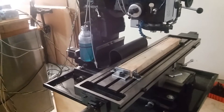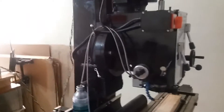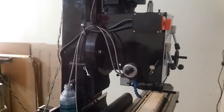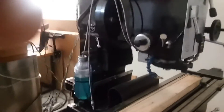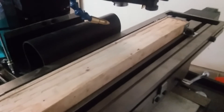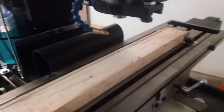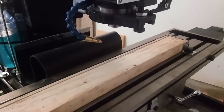Just so you know I can't see anything. That's fine. All right, now we're going to go to Z. Just touch the up slightly. Keep going, I've got to see it. It's going down, so we've got to reverse that one. Now for the Y again — Y plus should be coming out to me. So go plus. I believe that's correct. Try X plus. X is going the opposite direction, so X and Z need to be reversed.